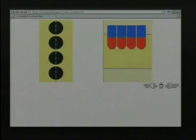Most people think that locks, this is sort of a top view. These pin stacks sit in little chambers that are drilled right through the housing and right through the plug. Most people think they must be in a straight line because that's how they would be manufactured. Now, by design, that's correct. That's theoretically what's supposed to happen. But tolerances aren't perfect when locks are machined. Some are worse than you could ever imagine. Now, this is exaggerated, but a lot of locks will be out of line. They're not going to be perfectly in line.